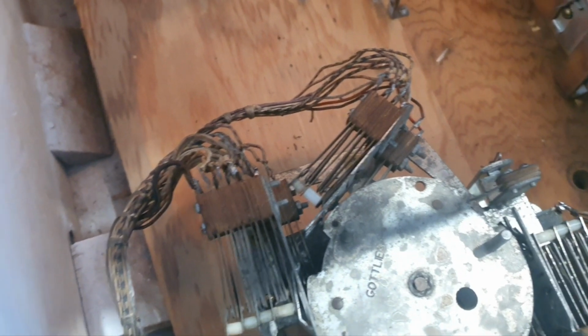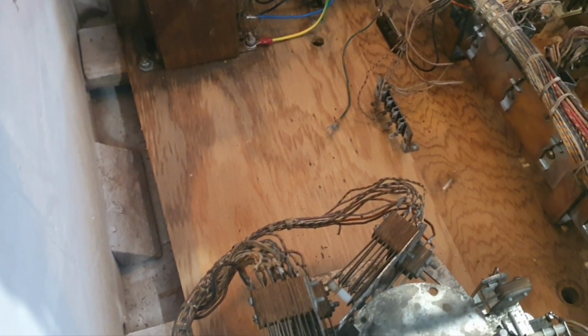Right, so further testing on this problem on Big Shot with the bonus scoring erratically, we were still having a few problems, and we brought it down to the hold-on switch on motor stack 3C, this switch here again. I mentioned previously it had been repaired. That's the inside switch. So both contact points had been soldered on the other side. They must have been loose.